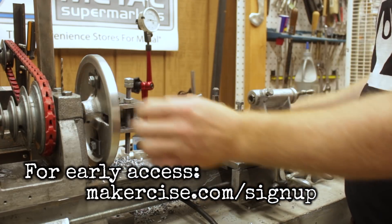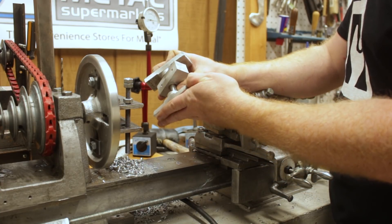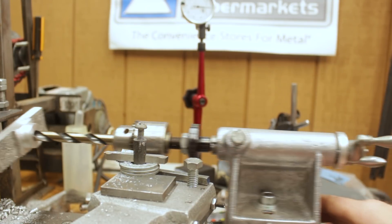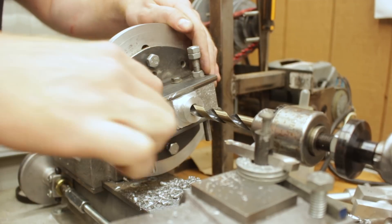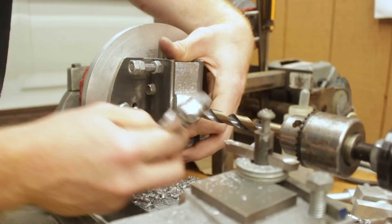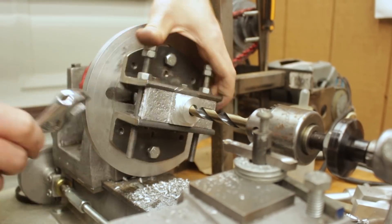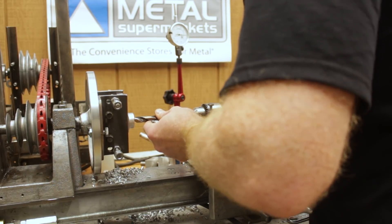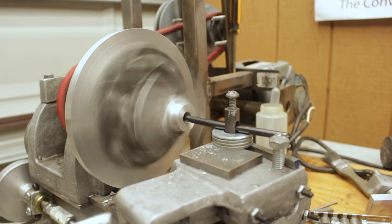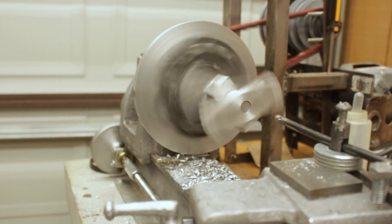This would have been a really savvy place to bore this hole to 12 millimeters — unfortunately I didn't. I tried to line it up as well as I could using the drill bit still in the tailstock chuck, and that really didn't work that well. I know you guys are probably out there screaming 'get a chuck, get a chuck,' but I will make one eventually. I got it to within about 10 thousandths plus or minus, and fortunately that was all it took to get that hole to 12 millimeters and a pretty good fit for that shaft.